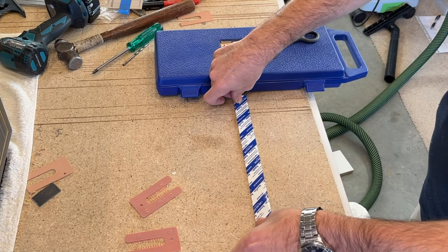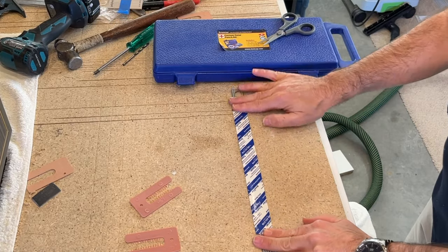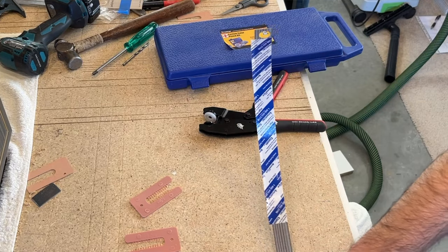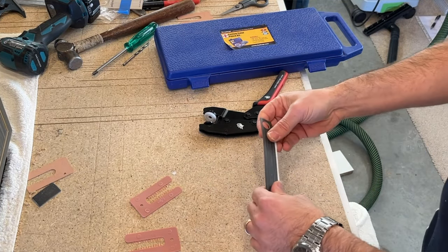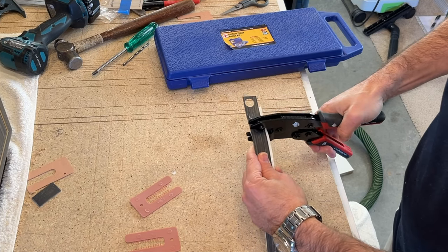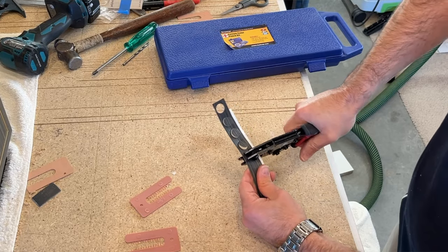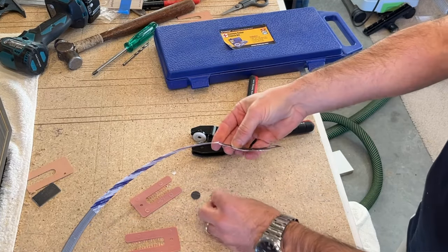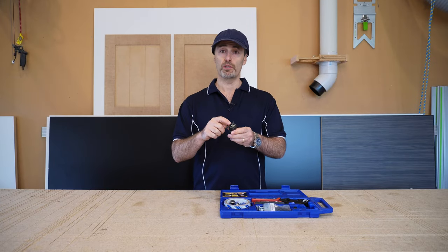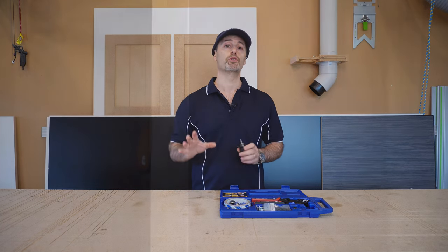So if you're using, for example, a 1mm edge tape, which is what I often use, I just reuse my edge tape from my board. I punch out the screw cap covers myself using this FastCap kit. And you've probably seen me use this FastCap kit before in my videos where I'm making my own screw cap covers. So this actually works in conjunction with this, and so your screw cap covers sit flush with your joinery.